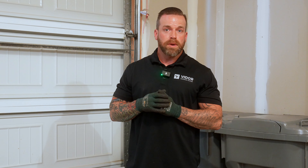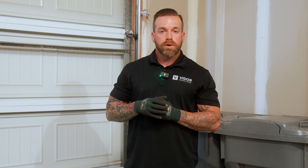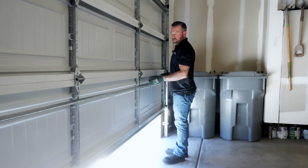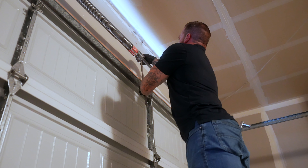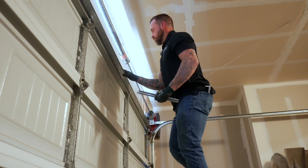The first thing we'll inspect is the balance of the door. We'll disconnect the door from the motor and just lift it up — about the length of an entire panel, so about two feet — then let go. It should stay right there. If it falls down, it's dead and we'll need to add cable tension by adding a couple more winds on the springs. In another scenario, it could be too hot where it shoots up — in that case, we'd take some turns off the spring. This keeps the door balanced so the springs do all the heavy lifting and the motor is just guiding it. It also keeps cable tension up at the top when the door is fully open, so it doesn't come unwound from the drums and prevent the door from closing.